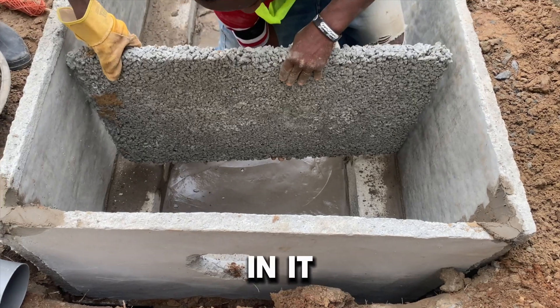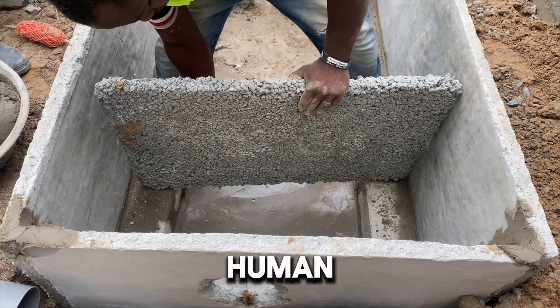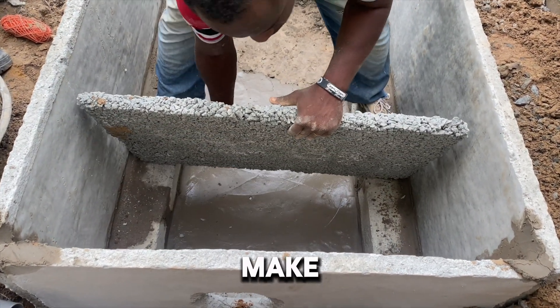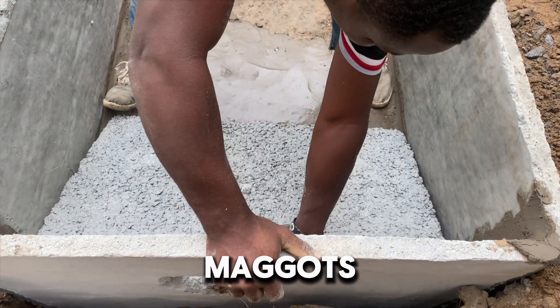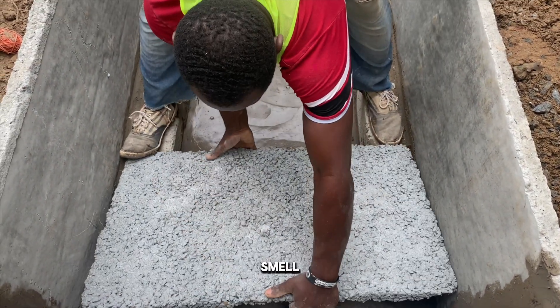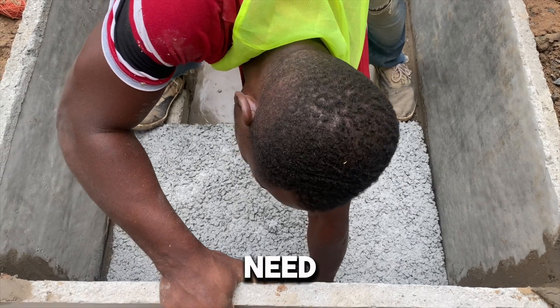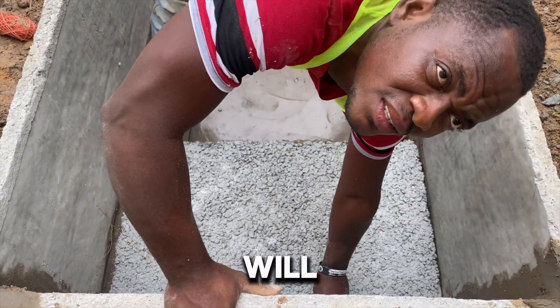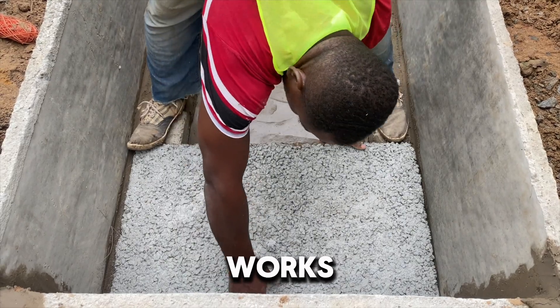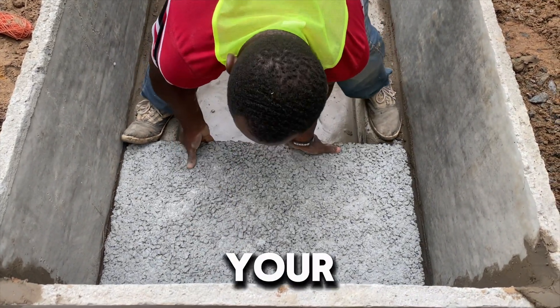Because it's not a holding tank, there's not going to be a mixture of human waste with water, which would make it smell and introduce maggots and other things that make human waste smell. You do not need a vent on it, because the moment you separate the water from the human waste, the feces will not smell. That's how the technology works, and then biodegradation will take place.